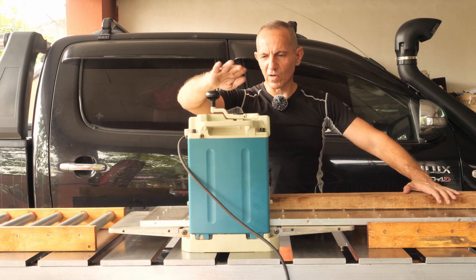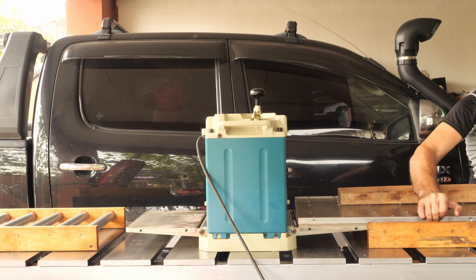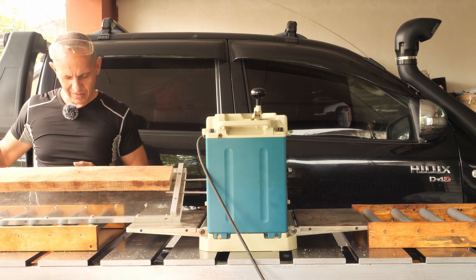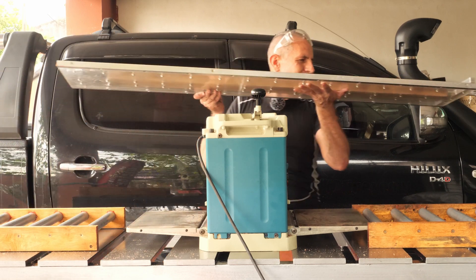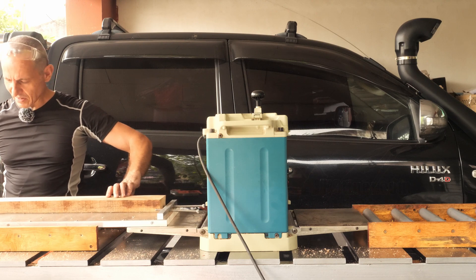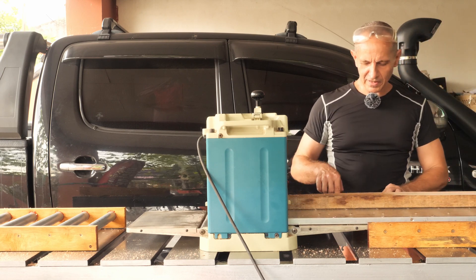Let's do the dry test. One full turn is two millimeters, so half a turn is one millimeter. I have to admit this acrylic sled is heavy, so you can use it as your gym too. It was just the first cut, and it cut slightly — correctly on the side that is twisted — so it's a good sign. As you can see the sled is working: the board is being cut on the cup first and on the twist. All is good. We'll take it slowly. I made the sled 298 millimeters wide.